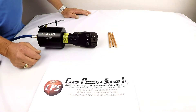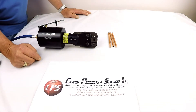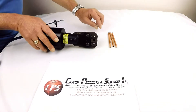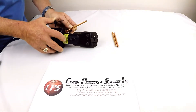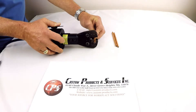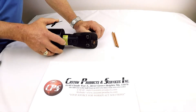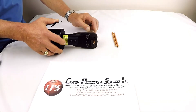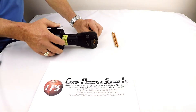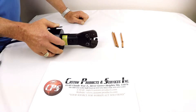It's also equipped with a set of tube guides. This particular one is set up for quarter-inch tubing. The tube guides allow the technician to place the tubing perpendicular to the jaws, which allows them to get a perfect crimp and tube position each time. They could be used without the guides, but the guides ensure the tubes remain perpendicular.